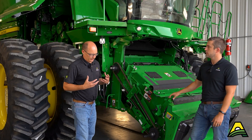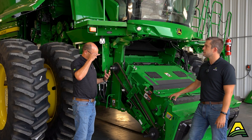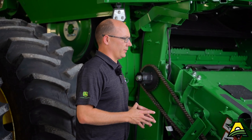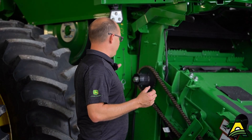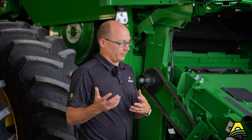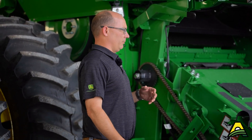My personal combination that I like the best, especially in corn if you're doing a lot of drier corn — if you have a lot of corn testing at 13 to 15% moisture — is the low speed feed accelerator kit with swept back feed accelerator paddles. That will get you your most optimal grain quality. Even in soybeans, if you get into really dry soybeans below 9%, flipping over to slow speed and having those swept backs will give you a lot less splits.